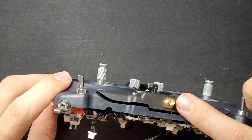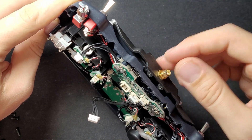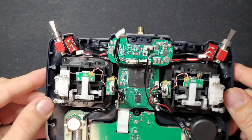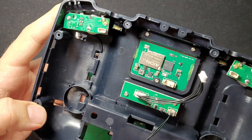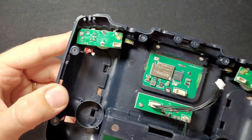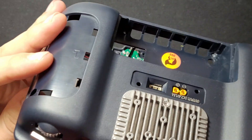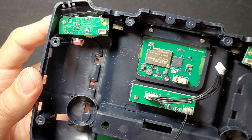The antenna can be easily replaced with an external one — it does come off. Maybe you could put a nice foldable T-shaped antenna there. The RF module appears to be glued onto the back radiator with no fan to cool it, so the back radiator will get hot. Being on the outside should provide good enough airflow to sustain that one-watt power.